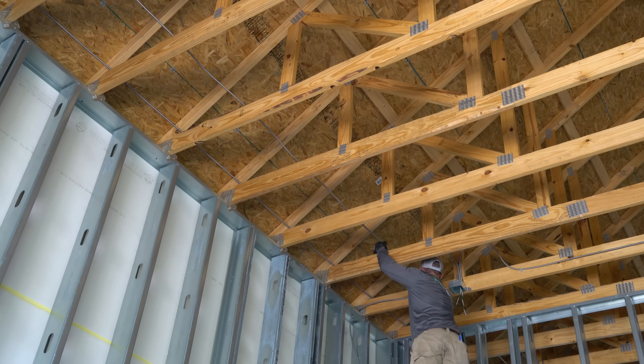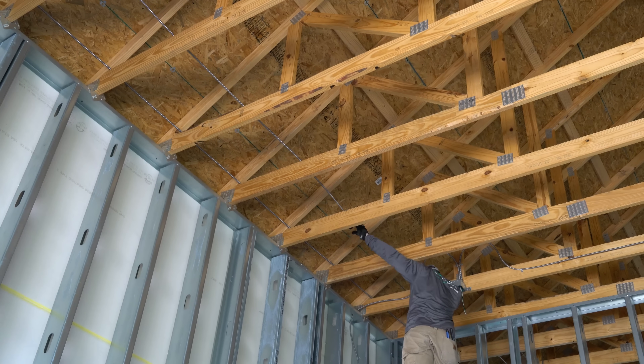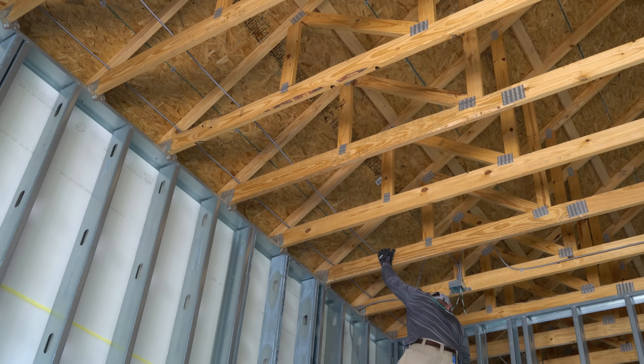Normally I'll pull three or four home runs at a time in a larger place, whether residential or commercial. But this is such a small job that I do each home run one at a time. I'm also being really careful with wire prices during COVID — everything is a lot more expensive. I want to keep my full rolls full in case I have a long run, so I'm doing these one at a time to not waste any conductor.